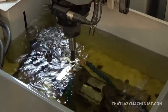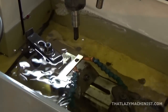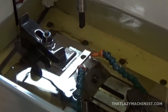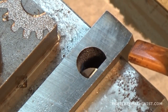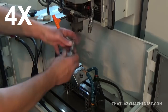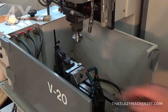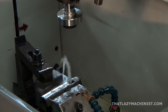The hole is complete, but remember it has been a long process — sped up here by jumping over several cycles of electrode in, electrode out — hey, it's the magic of video. There's now an accurate D-shaped hole in a piece of hardened tool steel. Now that we have that hole, we're going to use it to flush upwards through the part for our large profiling electrode. Large profiling electrodes have large surfaces and are notoriously bad for arcing, so we really have to maximize the flushing between that electrode and the part it's cutting.